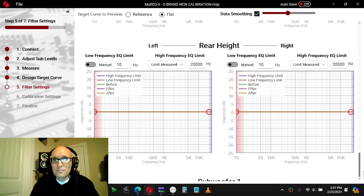So my speakers are in small right now. And I did say I shouldn't test things on a video, but the roll-off that gets applied, two things, like with the LFE channel, like 120 hertz, that phase needs to be taken into consideration as well. Because you could phase align perfectly with your speaker set to large, but just adding the roll-off, the 80 hertz roll-off crossover, could just affect the speakers and their timing in a completely unforeseen way.